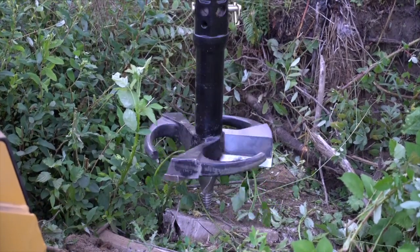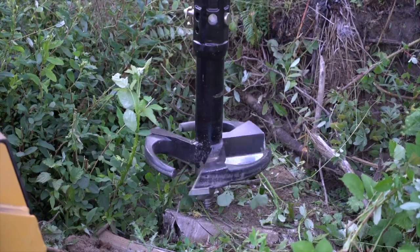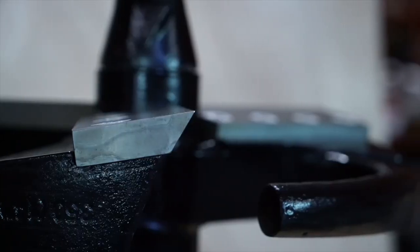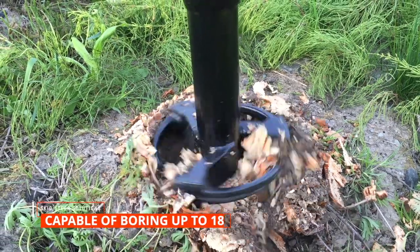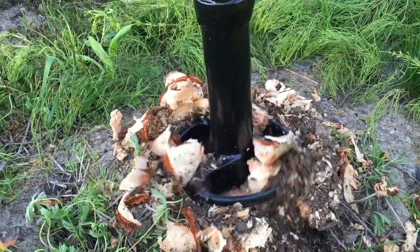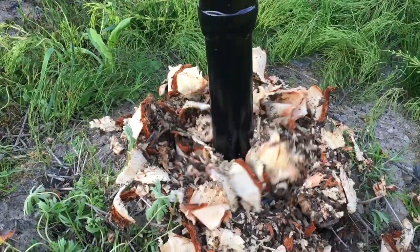The stump planer has a starter tip which feeds the planer all the way through the stump, so it doesn't overload itself with cutting surface area and it prevents it from getting stuck. The planer has three steel tool cutters, which are replaceable and can be bought at any time. It can bore up to 18 inches. The retaining pin on the stump planer ensures that the pilot tooth will stay locked in place, but it also ensures that it's easy to replace once it gets worn down.